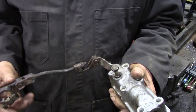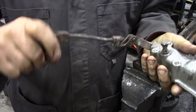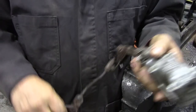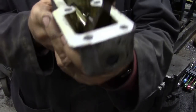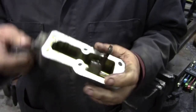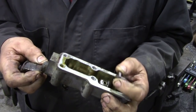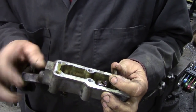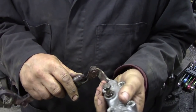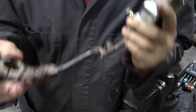This is off the NAS spec 90 and these linkages are really, really tight. This one here just won't move at all — oh, there it is, it just moved. But it's so stiff. What it's done is, when I was checking this out, I thought it was moving, but I was suspicious and took it off. You can see — although I'm holding this part, this other part is moving. So it's coming loose in here. We've got to tighten that up and take these pins out and clean them up. That's all it is — just cleaning up — but when we put them back on, we cover them with grease, we really grease all these up.